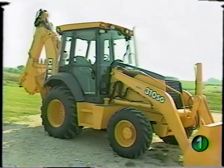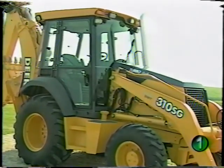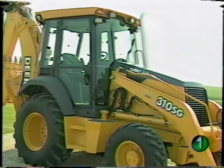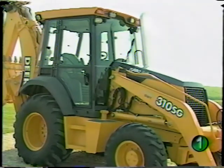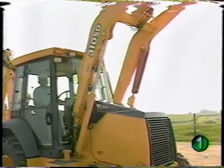Although we're showing several different G-Series units, the daily checks and service locations are the same or similar for the other G-Series backhoes. These daily procedures should be performed with the loader bucket setting firmly on the ground. However, if the loader must be raised for service work, always make sure it's supported with the locking bar.